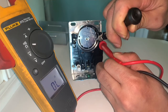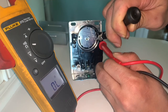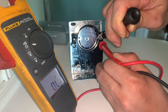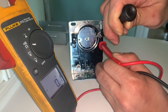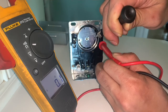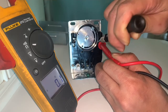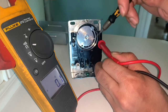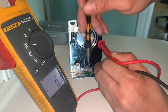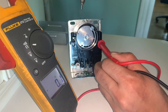Once this spins backwards and it cools down — the heat exchanger cools down — it will close the line. It will open the gas valve and your furnace will start to heat the heat exchanger again. If you put your meter like this and it's not making this sound, it's more likely that this switch is bad.